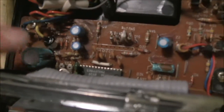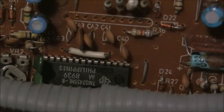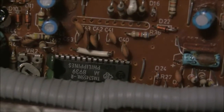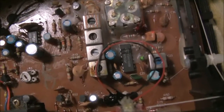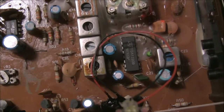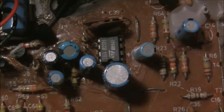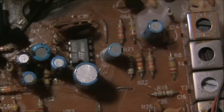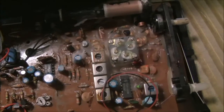My suspicion is this cap is bad. And that TMS-3455 chip, you can see down in there — that is the actual clock radio itself, that's the actual clock. Not really sure about anything about it; I can't find any complete data sheets for it. There's a TDA-1220B for the AM and FM-IF, and a TBA-820M for the audio amp. That's actually probably part of the reason I like this thing — that chip. I have tested those and they have like a distortion signature; it looks like a tube amp almost. Volume control needs cleaning. There's the AM antenna and of course you've got the speaker.